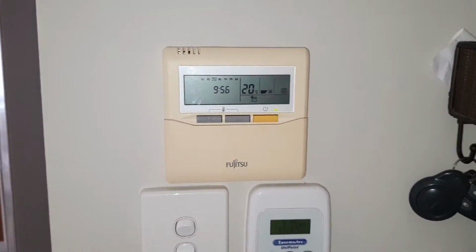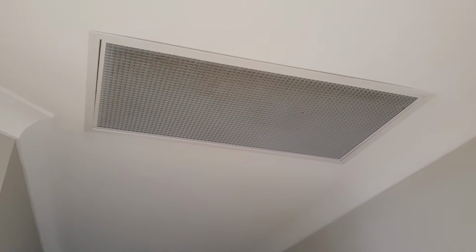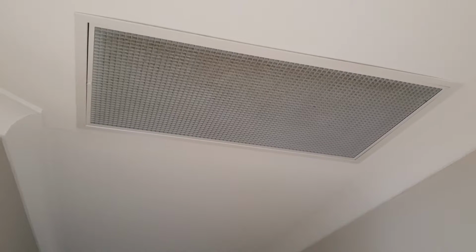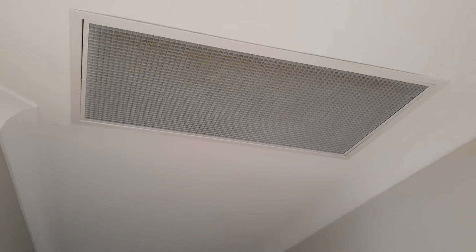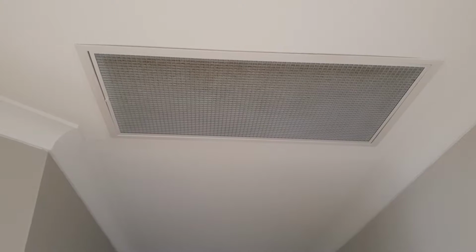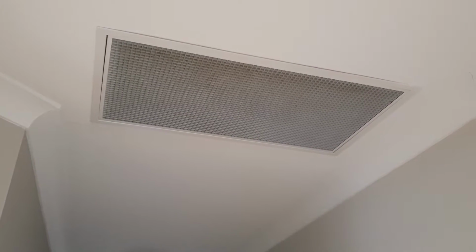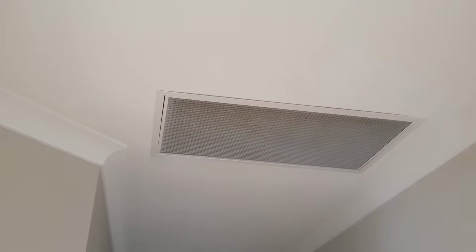The one that is set up by default is actually located somewhere inside the intake air tubing, so probably closer to the actual air conditioner, which is sitting somewhere in the roof. And obviously in the roof it becomes really hot during the day and really cold during the night, and it does not represent the temperature in the house at all. But maybe it works for some commercial applications, I don't really know.